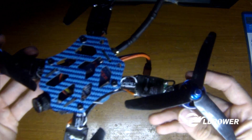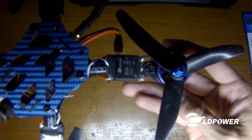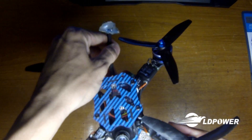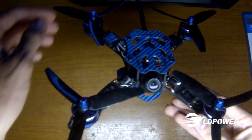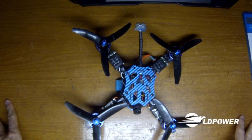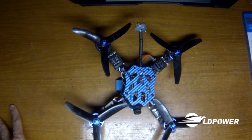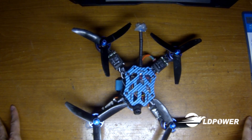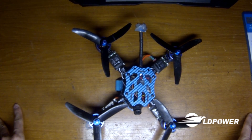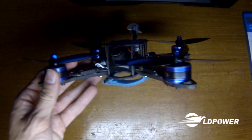You can see the 20 amp ESCs — I had to do a little bit of adjusting, had to re-solder the cap on the PDB and shorten up some wires. I never got to actually figure out what firmware they're running because it was all locked up and they didn't want to tell me. But I will say, for a proprietary default program, these ESCs are pretty nuts. It's not BLHeli, it's not oneshot compatible, but even with that, on basic Betaflight 2.6, it still flew incredibly smooth with tons of power and torque.